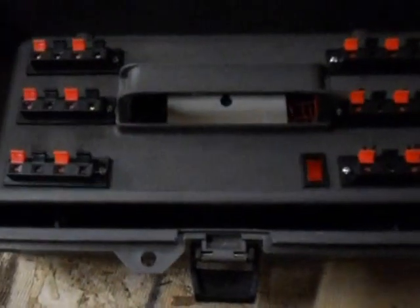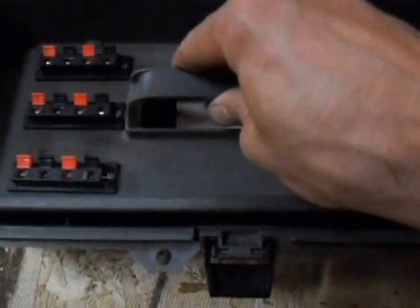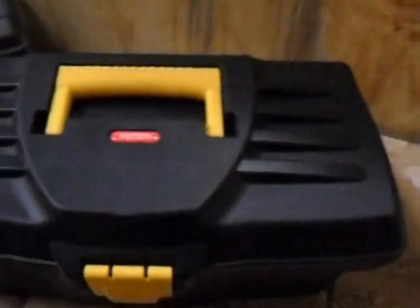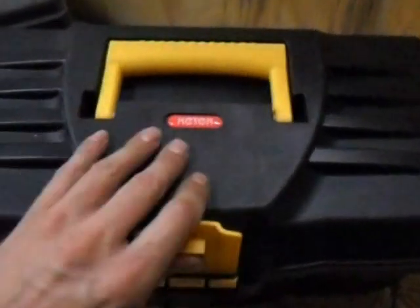I went with two 6-volt batteries wired in series to get 12 volts out of it. The 6-volt batteries were significantly thinner so I could fit them down in there — with 12-volt batteries I wouldn't have enough room to close the lid. That was just something fun I did, and it's the precursor, if you will, to this next firing system I'm working on.